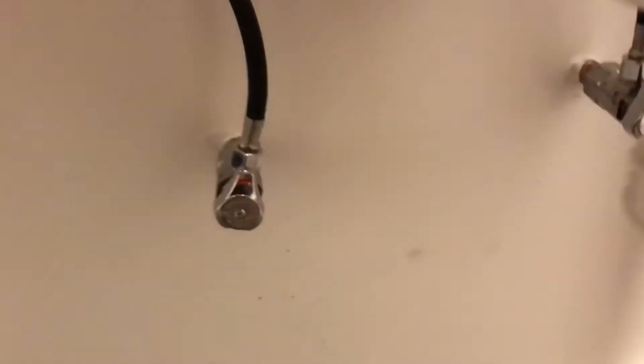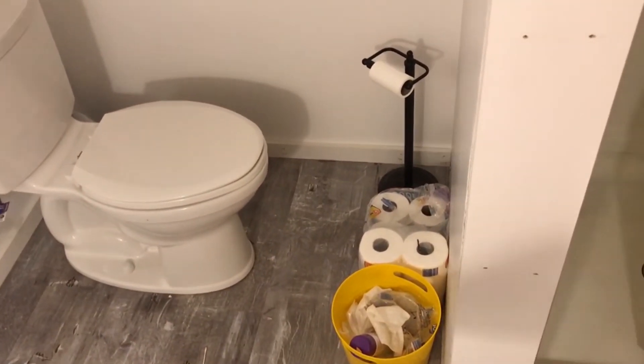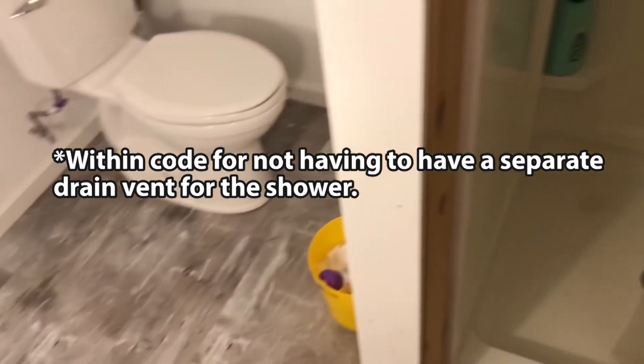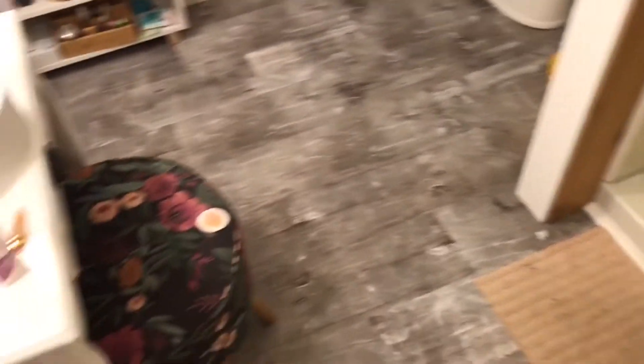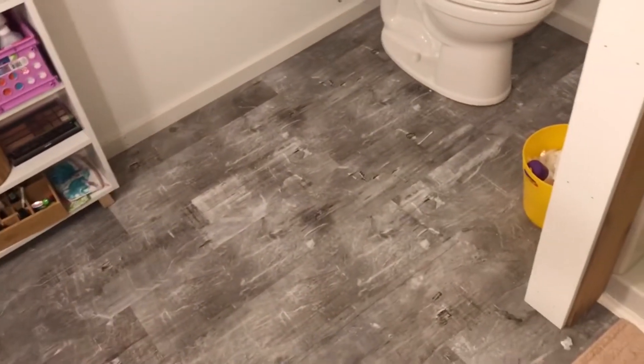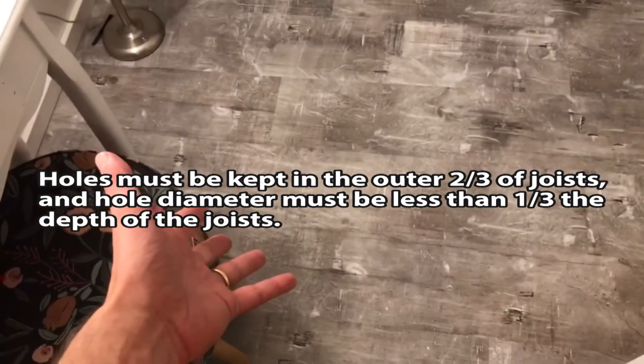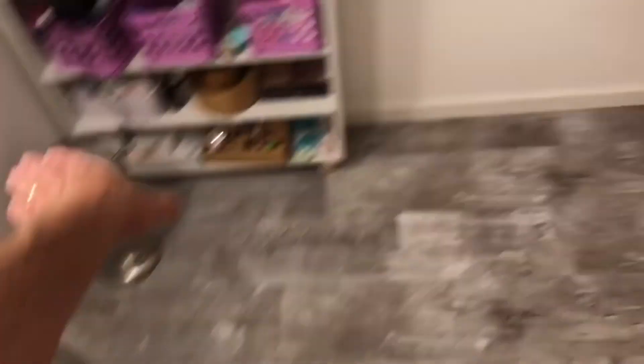The way the floor is done is to get the height you need for the drainage. These drains are roughly about six feet apart — they were just within code or right around code. I did not want my drains to go through the floor: for one reason, you're not supposed to cut holes in the center of joists as it weakens them, and for another, I only had two by six joists. So I was determined to go around the outside of the knee wall.